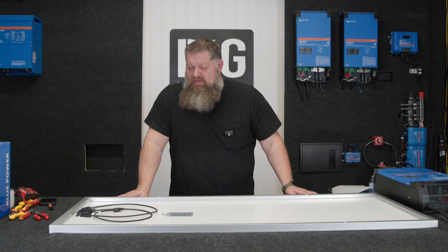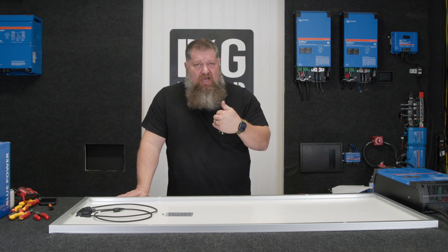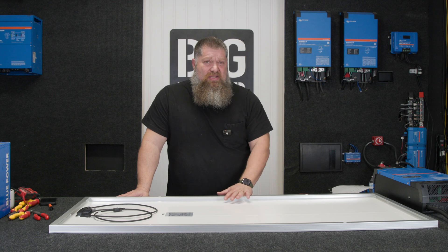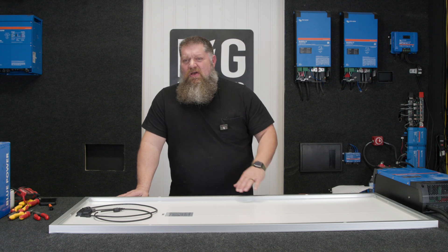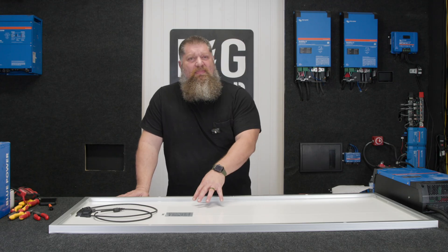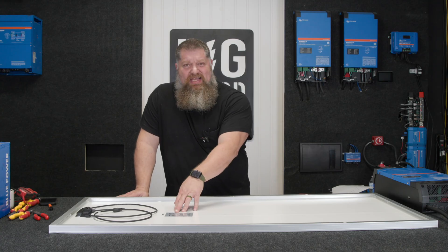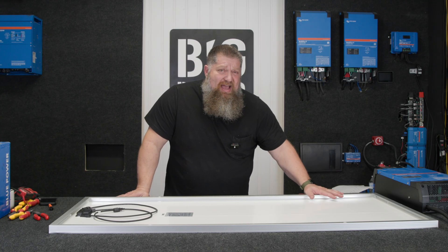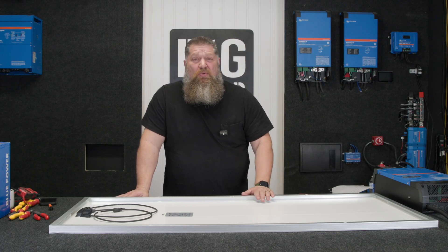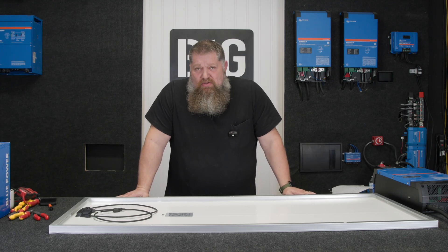You could take a good estimate and knock off 30 to 40 volts on a small array. I'm often talking about this in relation to RVs, but some viewers are coming from a home installation with a larger array — definitely use the toolkit for that because the array is way larger. Keep in mind that we always use the highest numbers from the data plate, factor in the temperature coefficient, and don't want to be anywhere close to the highest number. Use the toolkit and have a wonderful solar day.